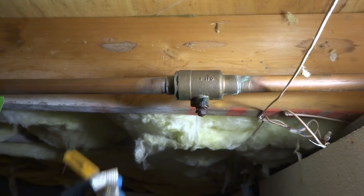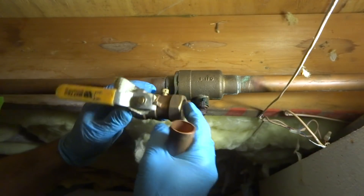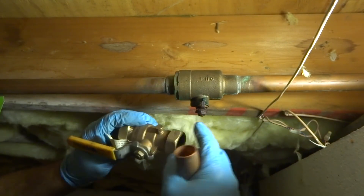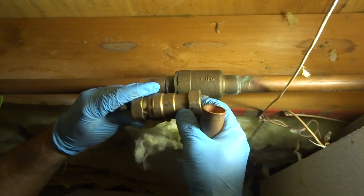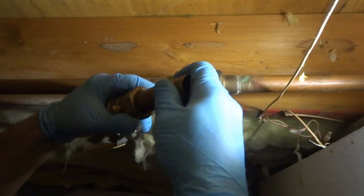She's a crusting one - look at the stuff in there. I bet there are mice up there. I got to change that. The water should be off because I got a compression ball valve with a bleeder, so that can go. The bleeder has to go on that side, like that, and then that'll pull down and go in there like that.